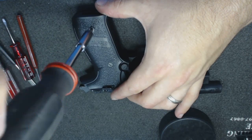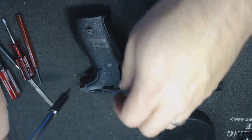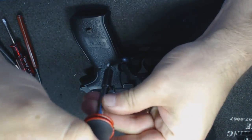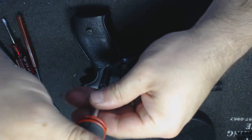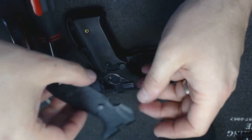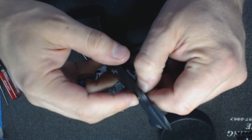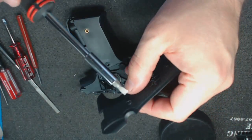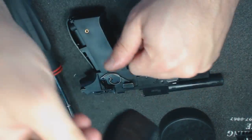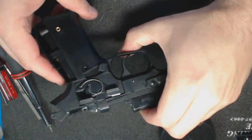When you take the grip screws off, on this one, you really want to make sure you've got a nice set of appropriate screwdrivers that can fit in there. These screws sit down nice and flush, and they have a very thin screw surface. So if you try to get in there with a regular screwdriver, you'll probably monkey it up pretty bad. Once the screws are loose, you can pop it right off. Do keep the screws with the right hole. They are all technically the same size, but the bottom one goes into brass and will already have a layer of brass on it, and you don't want to keep wallowing the brass out. So keeping the same screw there keeps it mated.